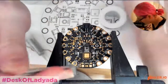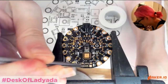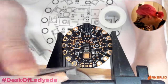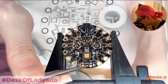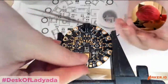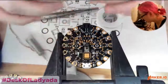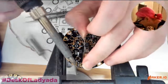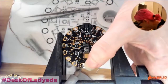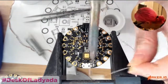And you see how these are slots, but they're plated slots. The gold-plated copper goes all the way through, and then there's these mechanical points here. When you actually solder this in an oven, there'll be paste down, and it'll heat up. I'm not going to do that for this, but I am going to solder these through-hole parts pretty well. But when you do your surface mount production, the paste that gets placed on those pads is enough to keep them in place. And the mechanical strength is really great. So once you have those through-hole parts through-holed, even in a surface mount process, you can do it.